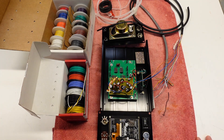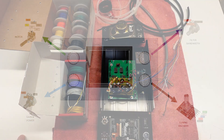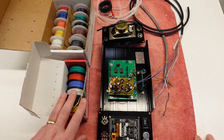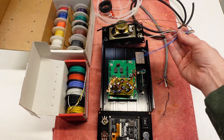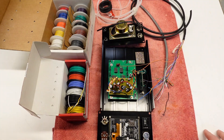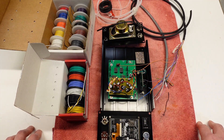It's time to start the electrical wiring. I've updated the diagram for this receiver to show the connections to the new display and all the other changes — it is fairly complex with a fair number of point-to-point connections. As far as materials go, I've got spools of new solid core 22 and 24 gauge wire in various colors. I also have some scrap pieces of multi-conductor cable salvaged for the conductors, which give me additional color combinations including striped ones, helping me maintain unique color coding for each connection.